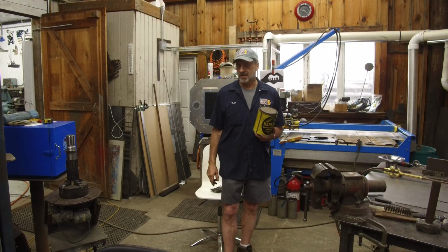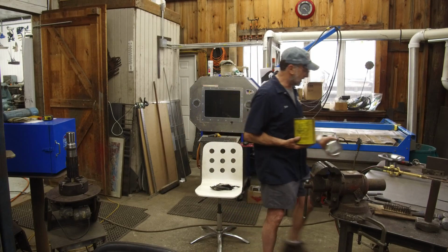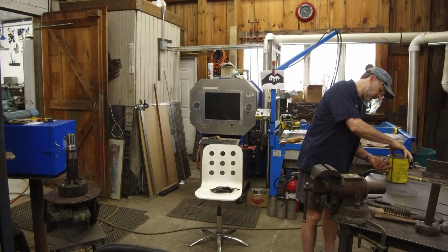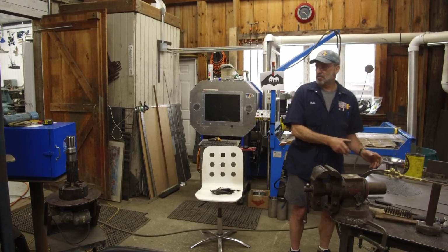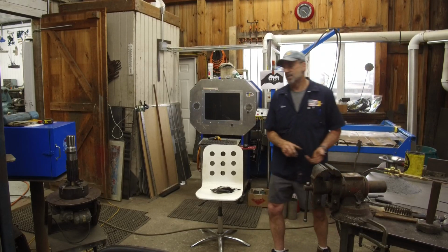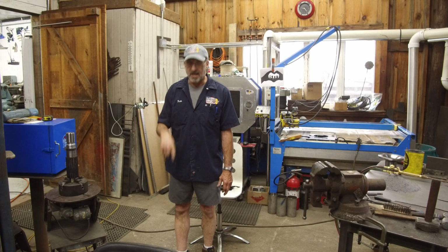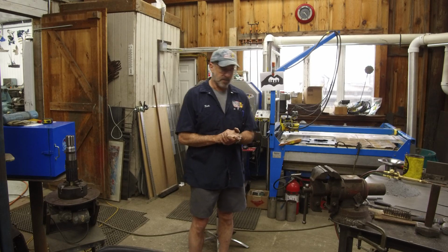We have a tub down here with water on the floor, and of course getting that and trying to dip that into the can is going to be a little rough, so I'm going to dump this out right here on this sheet of metal so I can reclaim that and put it back into the can. But this gives me an open area to go ahead and roll that spline in there to give it a coating, and we're going to slip it back in here and quench that, or bring it to a bright red again, and then quench it. And then if we get some results out of it, we're going to be totally happy. And if we don't get any results out of it, we're gonna send it as is, because it's everything that we can possibly do to rejuvenate a piece of junk to start with.